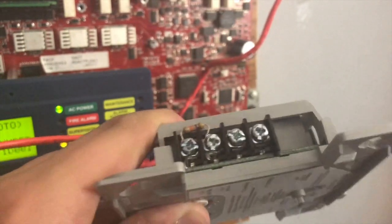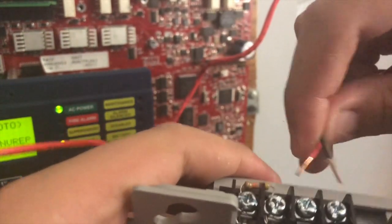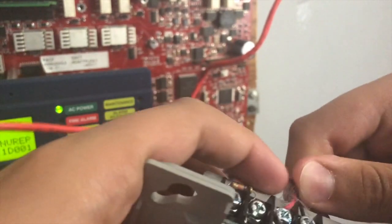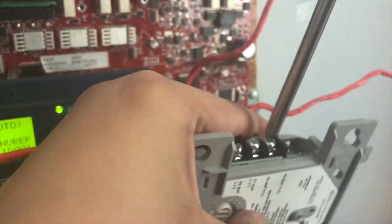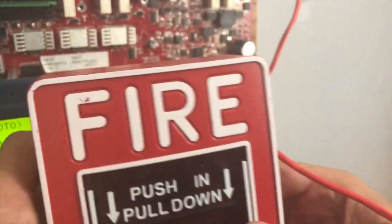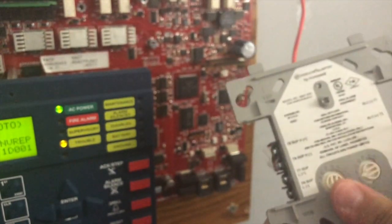For our demonstration today I'm going to be using only one of the monitors, but I'll still show you how to program it. So obviously you would just wire it up like this — no smoke detectors on here because it's not a powered module. I'm going to be using a regular standard BG12 hex lock, non-addressable, on the output side. And on the back we have the 47k resistor.